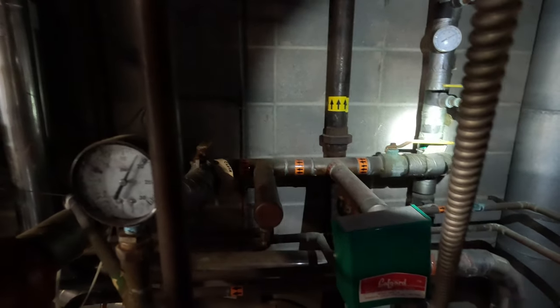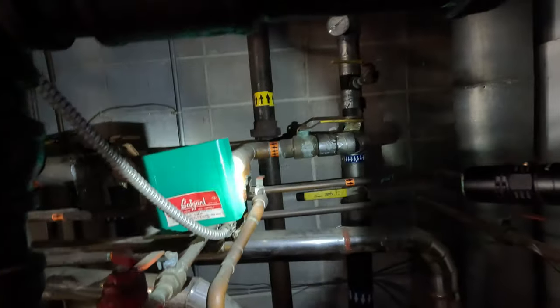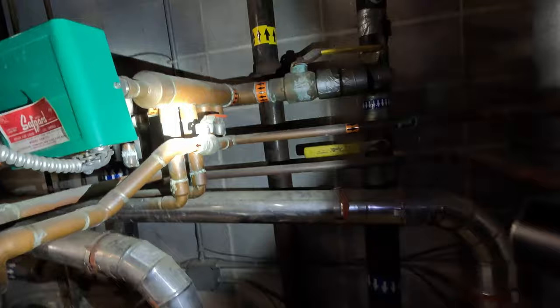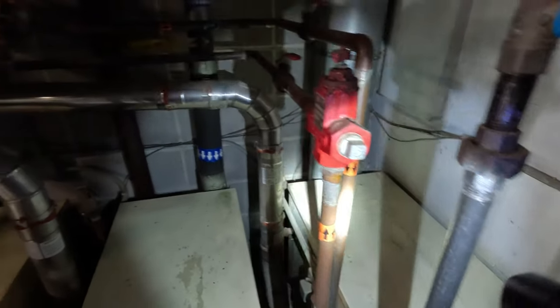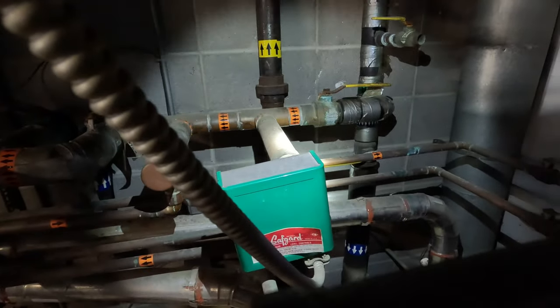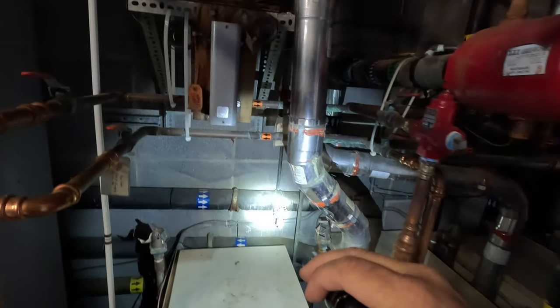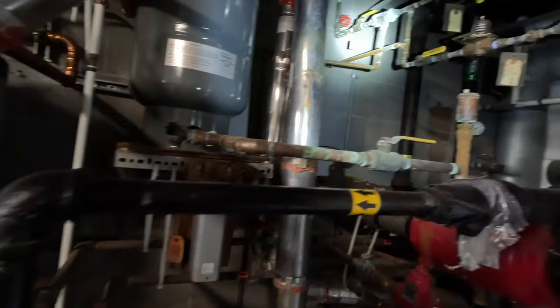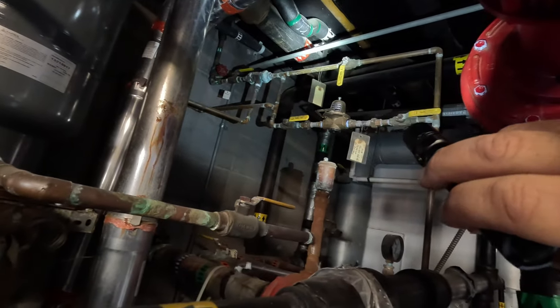You've got water circulating through here, over and up to the pump. This is a primary-secondary type line. The boilers here are all pumping into this area - all these little boilers come up these little lines, one going up and one going down. You can see little orange stickers. This right here is your boiler going out, this is your boiler coming back, and the water coasts through here done by this circulator pump. We've isolated it - that little valve there looks like it would be the drain valve but it's not. You can see they have the autofill here, you got a bypass and check valve, backflow preventer and some other stuff.